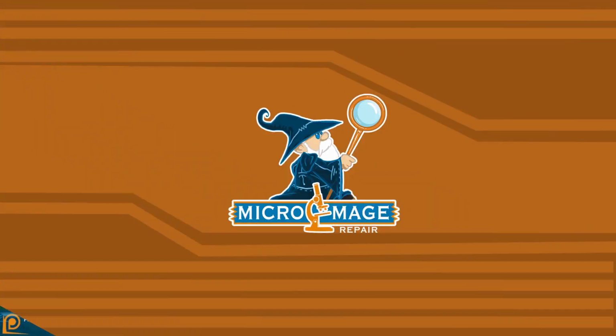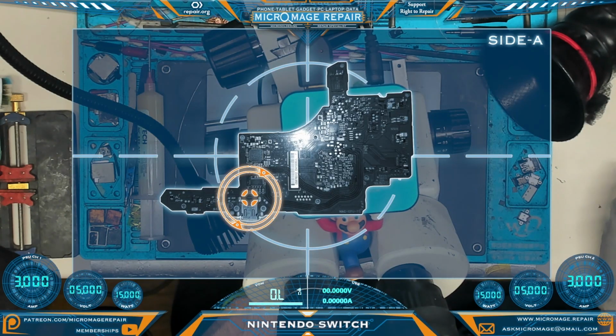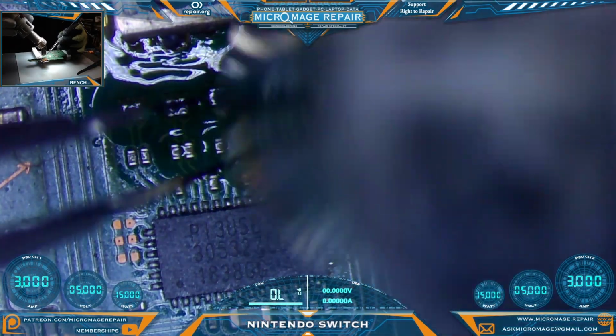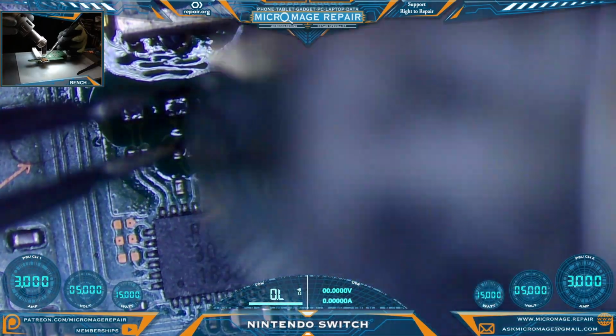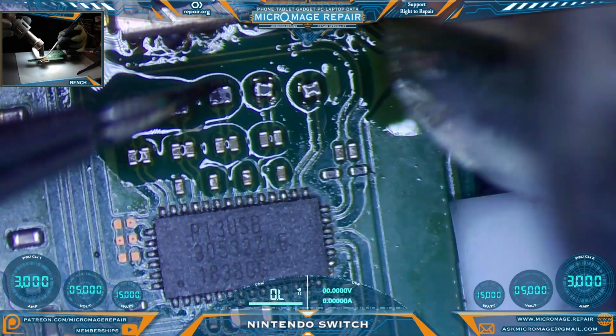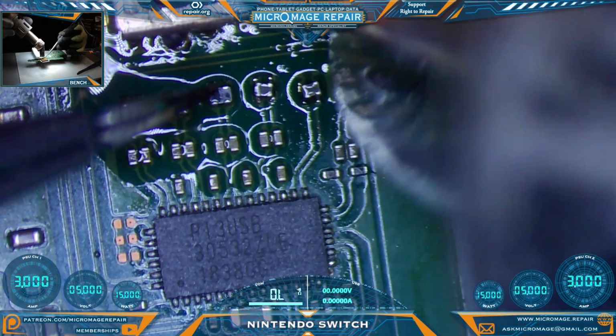Good feed through. Now we're going to move slightly up the board and work on these filters just right near the port. Okay, dropping our air to 20% and trying very hard not to reflow the port. I do know that they are not exactly the same size, but I do believe they're in spec.